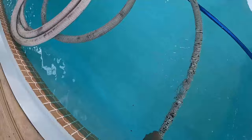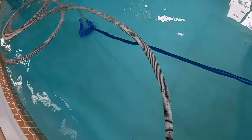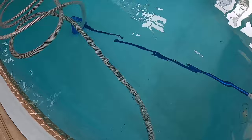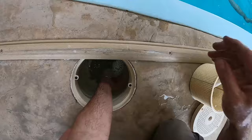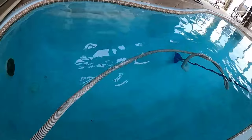As you can see, it's pushing all the air out right now. You can see the bubbles coming out of the end of the vacuum, and once all the air is out the line starts to sink — more bubbles coming out of the vacuum end. Once we know the line is full, cup the end of the hose and walk it directly over to the skimmer and lock it in place. You can see plenty of suction confirming the air has been cleared from the vacuum hose.